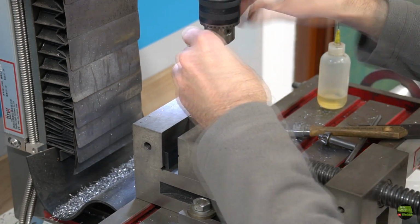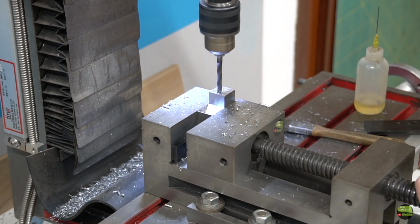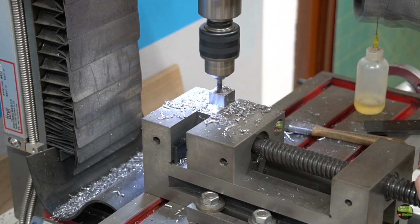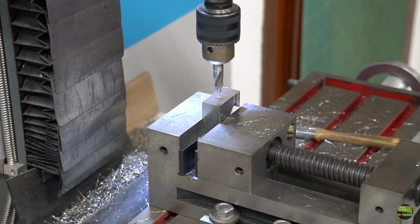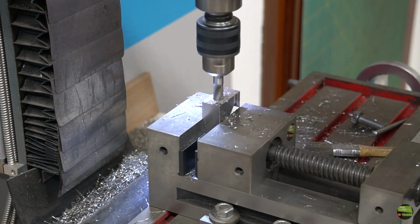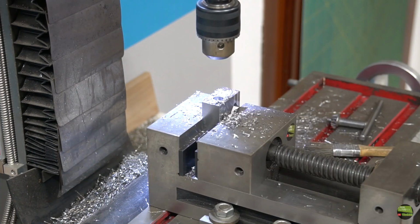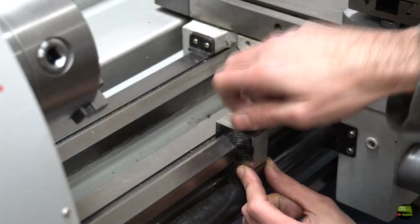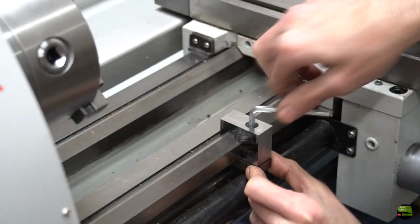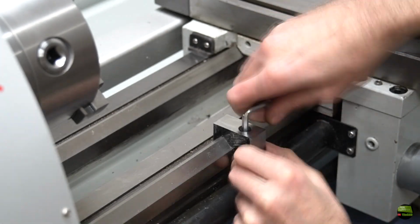Into the upper part I drill a 6mm hole for the screw and extend it on top for the hex screw head to height. Of course, cut some chamfer on every hole and thread. The blocker now fits perfectly on the way, so with a slightly tighter screw it holds the position rock solid.